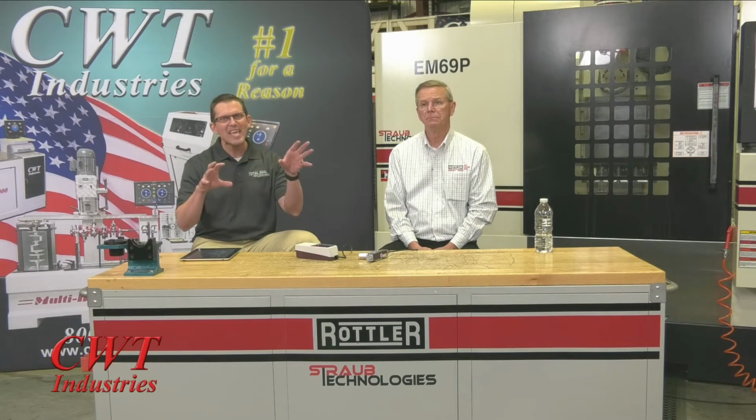It is really much a mixed bag of people's opinions and experiences with hot honing. The common theme that I've seen over the years is that, say, a billet aluminum block engine, pretty large bore, they'll have pretty thin sleeves. That engine will really respond in terms of blow by. Maybe not so much horsepower, but blow by, which obviously leads to contaminating the oil and affects how long the engine lasts. So I think in some applications, billet engines, thin walls, big bores where there's a lot of movement that can happen in that bore in operation, hot honing can be something.